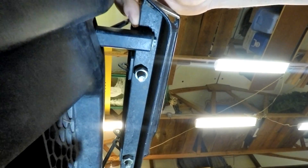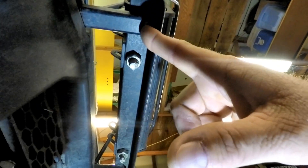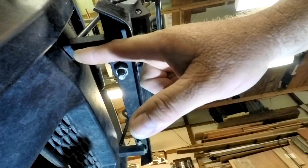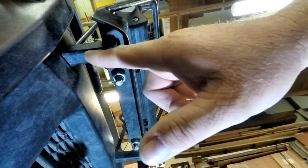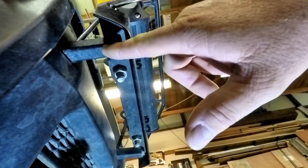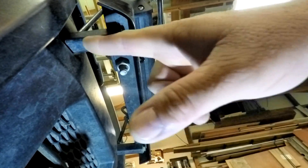This piece here is three-quarter-inch square tubing, it is two-and-a-half inches long, and it has got a three-inch quarter-20 hex bolt in there. The reason for that is on the front of this machine there are two torx bolts that are quarter-20. They go in this hole — this hole is square and it measures out about three-quarters of an inch inside. Perfect.